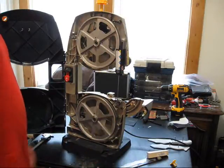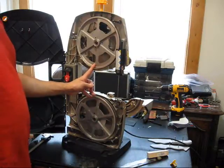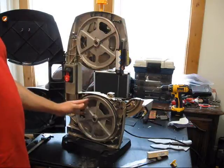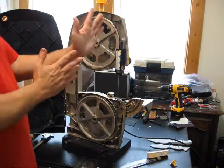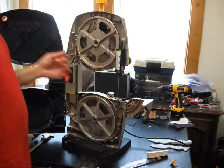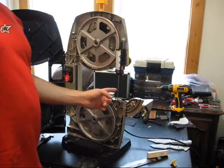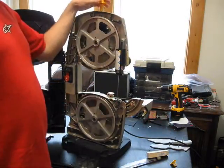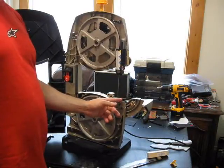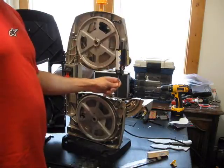Number two is the co-planarity. You don't have to worry about getting them co-planar because the factory sets it up a certain way. They're not really supposed to be exactly co-planar because it tracks better when they're not, supposedly. And for tension, you should check it by moving the blade to either side — it should only deflect about an eighth of an inch, because the blades may be welded to a different length.